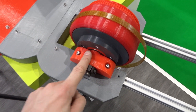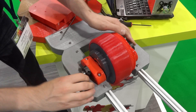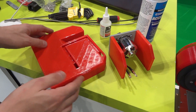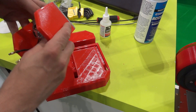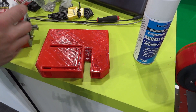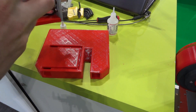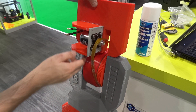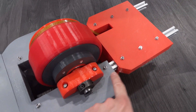That's most of it together — we've just got to get this back wheel finally mounted and then we can look at the motor. It's time to mount the motor on its special piece which also goes on the 2020. I've made a motor bracket with an ABS front in case the motor gets hot, because I don't want the PLA to melt. That slots right in there and we're going to glue it in with super glue and super glue activator. The belt goes on here and we can tension it by sliding this up and screwing it down.